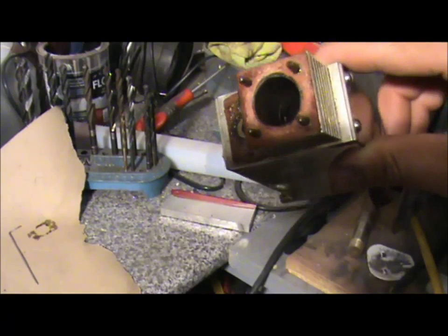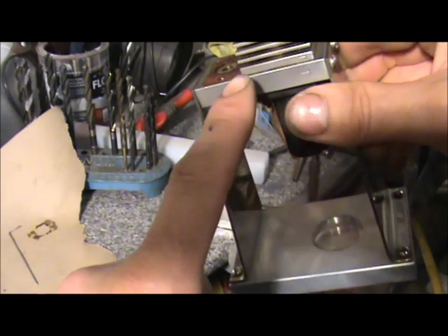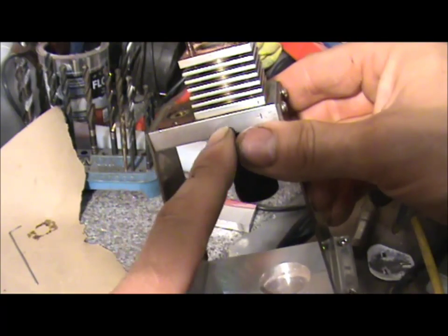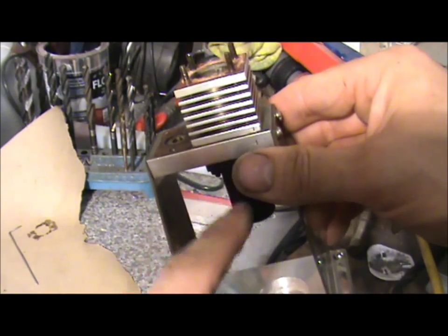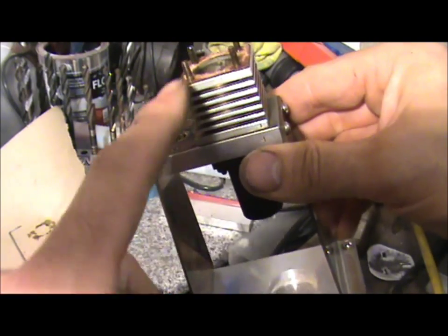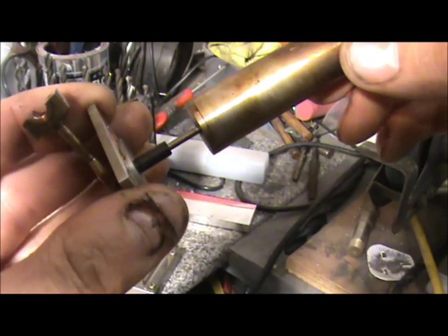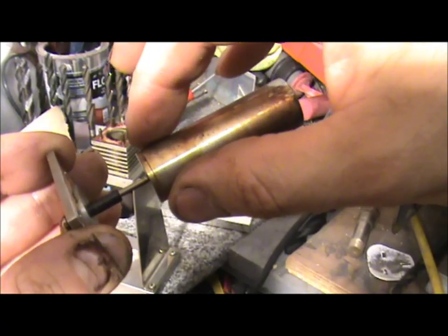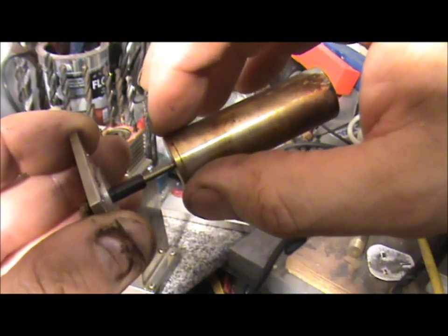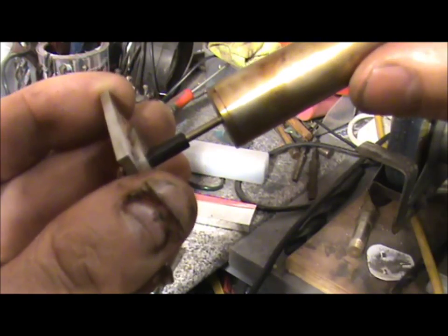I moved the camera and you can just about see it in the bore - you might be able to see the little hole, and that connects the two together. If I take this off there should be a plug - they're drilled right through, and that connects the two pistons together, so the air then goes to the cold-air piston, expands and contracts, and that's what powers the motor. I think I've sussed out how they've done this - you can see a little join there. I think it's been machined all out and then a cap put on it. I can't get it off - I think it's been glued on, and the cap makes it airtight.